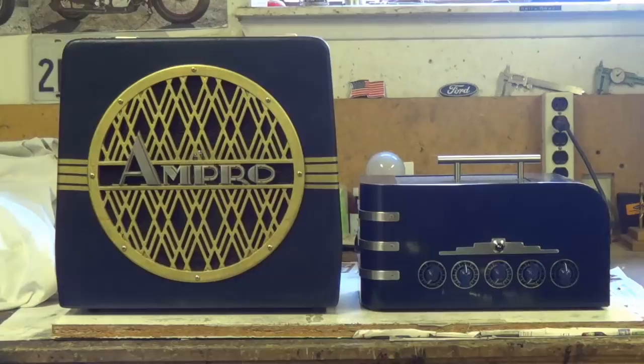In other words, we'll start off with the back completely sealed. Then I'm going to take the back off completely. We'll see how that sounds. Then I'll put back 1/2 of the back panel. And finally, I'll make 2 panels, one at the top and one at the bottom, which will cover about 2/3 of the rear with paneling, and then leave about 1/3 open.